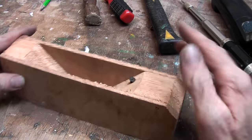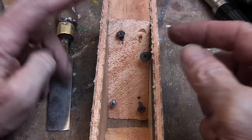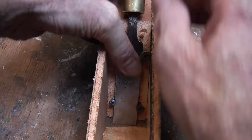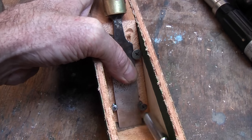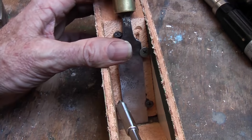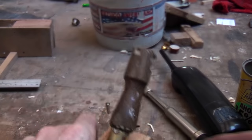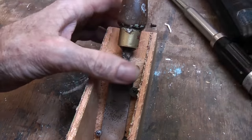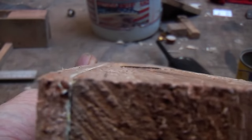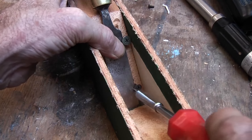It turns out like this — I chopped the end off here because it's even nicer to push with. I changed one screw position to give me sideways adjustment and tightness, and I only really need one for the up-and-down adjustment. Put the chisel in until it's touching the table, then tighten off the screws — not too tight because you still want to adjust the depth of the blade, just snug so it will hold. Then we can fine-tune it from there.